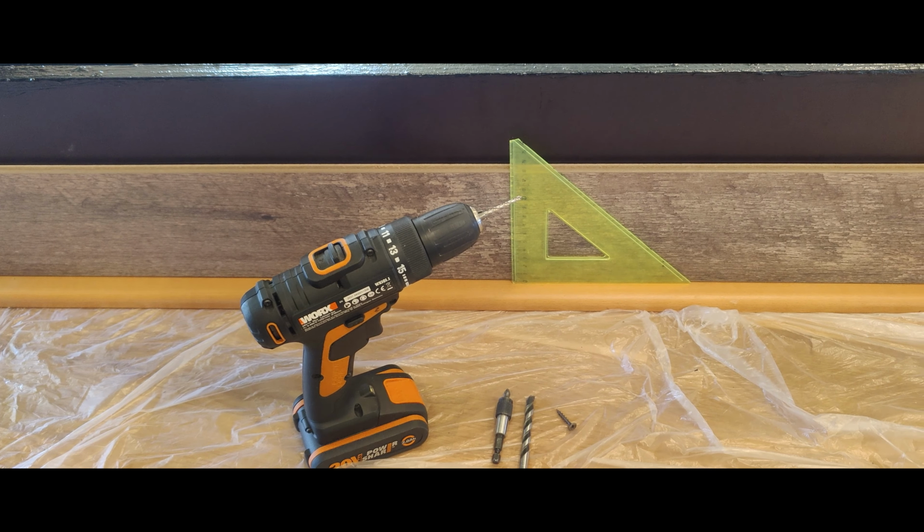So this is what you're gonna need: a wooden drill, a drill for concrete, a wooden screw, and of course your bit for screwing the screw on. I've chosen to poke my hole at 8 centimeters, so that's what we're gonna do. And in order to have a nice smooth looking screw there, we're gonna drill a little hole for the head of the screw using the concrete bit.